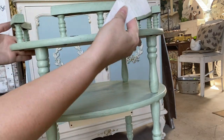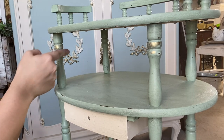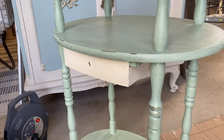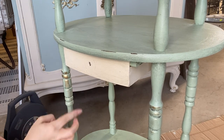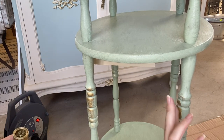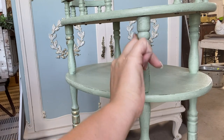I'm now going to be applying Dixie Belle's Gold Gilding Wax to some of the details. I've just got a little bit on my finger and I'm just hitting the round details on the spindles — I want this to look like it has aged and worn off over time. I don't want it to be too bright or too overpowering on this little piece. Dixie Belle has a lot of colors to choose from in this range: gold, silver, copper, bronze — so many to choose from. This is going to be your last step. It is oil-based so it will cure on its own, but you definitely don't want to try and apply a water-based product over the top of it. You can actually use this to color your hardware as well.